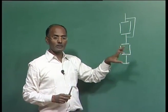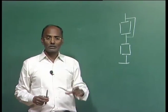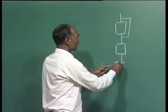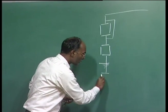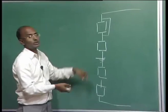So that is called energization of the bridge. Here I am talking about the energization of a bridge if you have more than one converter bridge in a pole. Pole means here I can say it is a monopolar, so the ground will be the return. So it's a two bridge configuration. If you have bipolar, then you will have two here, let's suppose, and any of these you can take out.